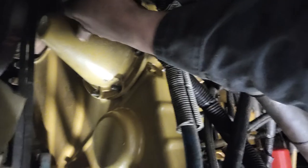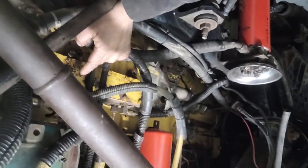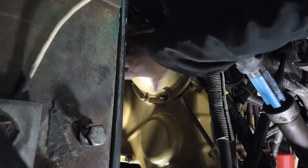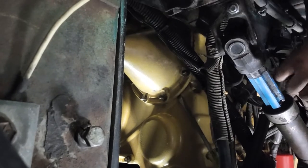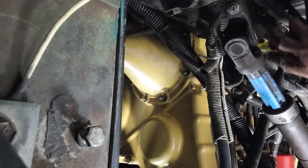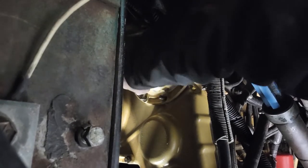Of course guys, the first thing is you need to take off the cover at the front. This is the front cover of the injection pump, and this is my injection pump. I already removed all the nuts, but because it's sticky, we need to apply force. Don't worry about the gasket breaking, because this is a cover only, so silicone is good. Or if you have a spare gasket, much better.